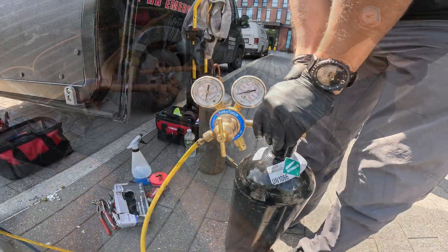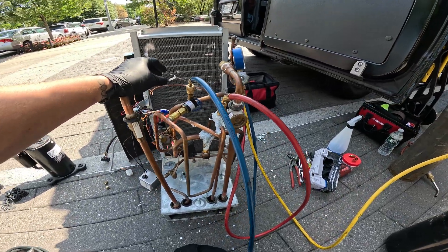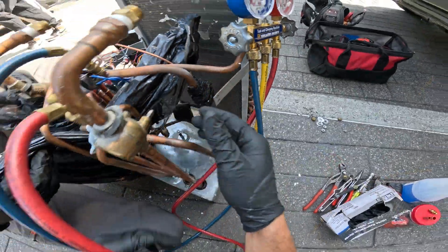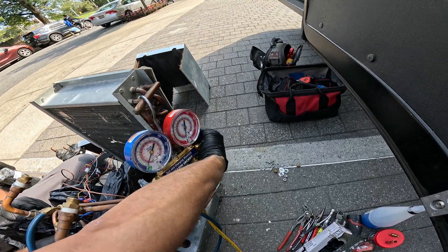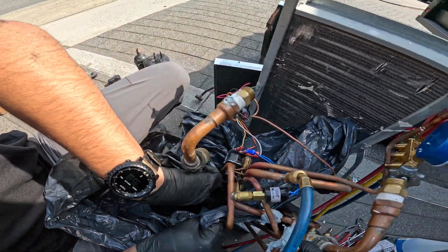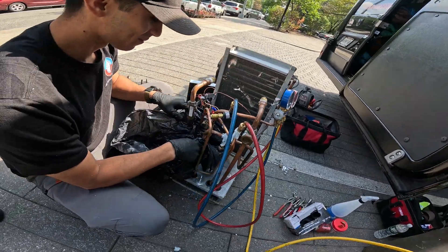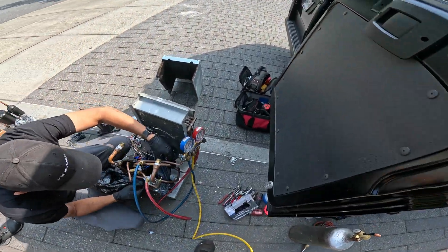This stuff is real cold. Let's open up the tank — now we're going to flush this line set with some nitrogen to make sure we get everything out of there. Let's grab a bag to catch any contents. This pipe is open here, so I'm just going to put my finger over it so it can really push through the high side. Now I'm going to open this up — it's coming out, got a little bit coming out. They say you don't want to go over 125 psi. Now let's switch over to the other side. You flush this thing out with the RX11, then nitro, and you're good to complete your job.